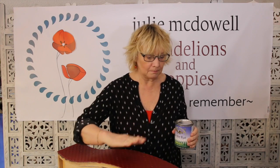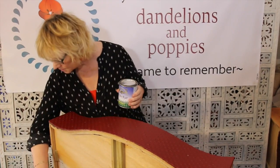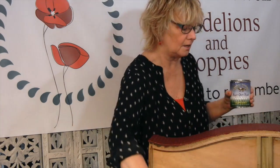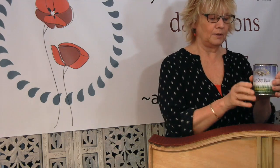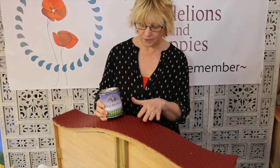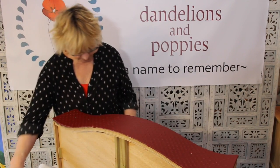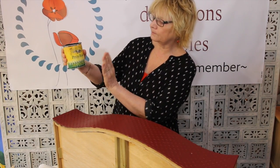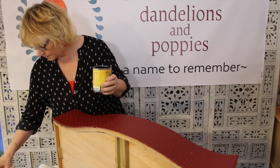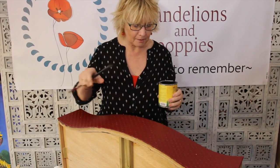This is now dry. It's only had one coat of paint - it's an amazing coverage actually, this chalk style paint. I've also given it one coat of varnish. This is another General Finishes product - they're all water based products, so it makes clean up great. One coat of flat out flat varnish on top. And next, I'm going to do a pitch black glaze over the top. If you don't varnish these chalk based paints, they are extremely porous and you won't be able to manipulate the glaze.